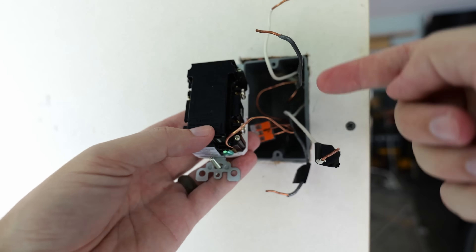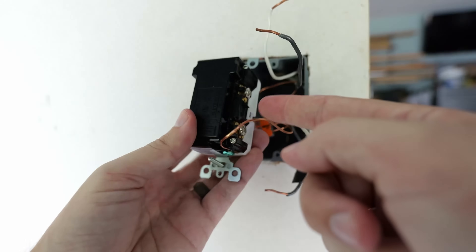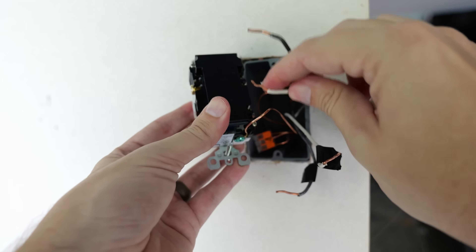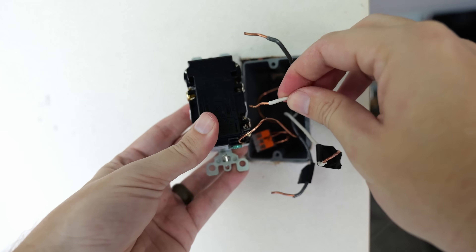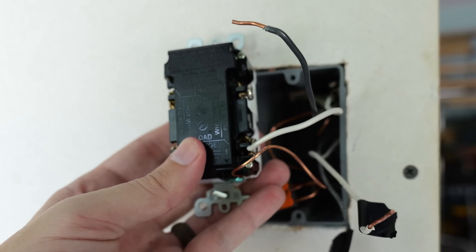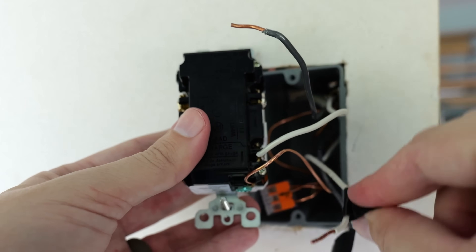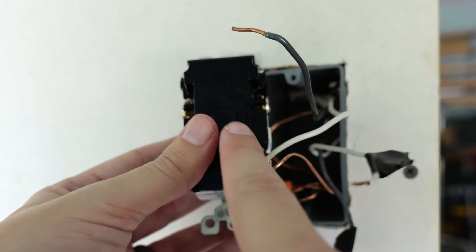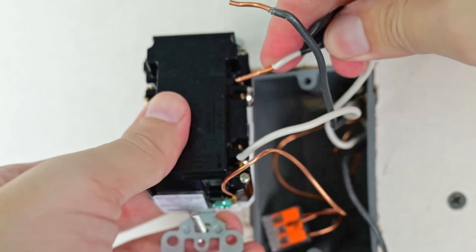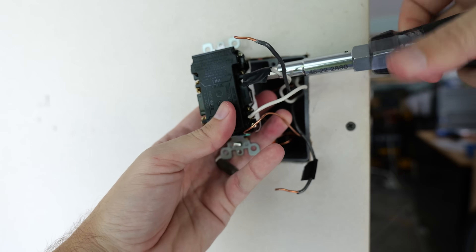Next I'm going to work on my white neutral wires. On the back of the GFCI it says 'white,' and if you flip it over the side the screw terminal color is silver. I'm going to start with my white neutral wire from the load side, install it on the bottom where it says 'load,' and tighten down that terminal screw. Then I'll take my white neutral wire with the flag on it — coming from the line side — and install it up here where it says 'white' and 'line,' sliding it under the plate and tightening down the terminal screw.